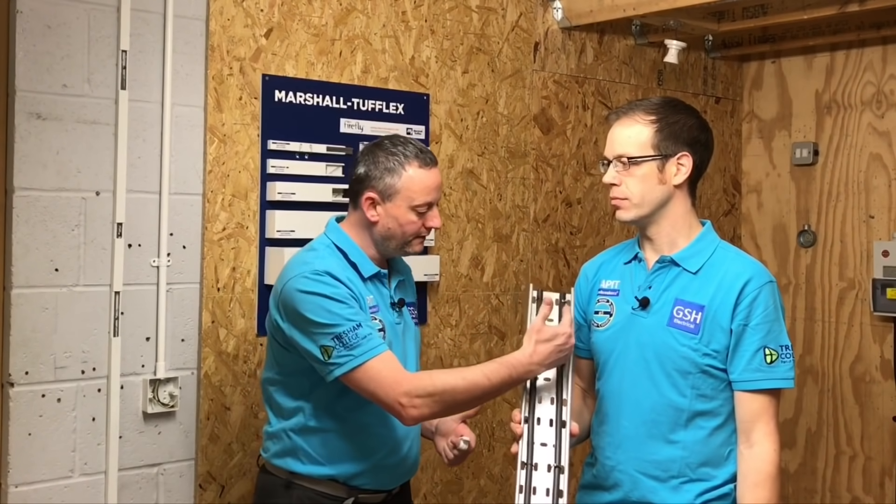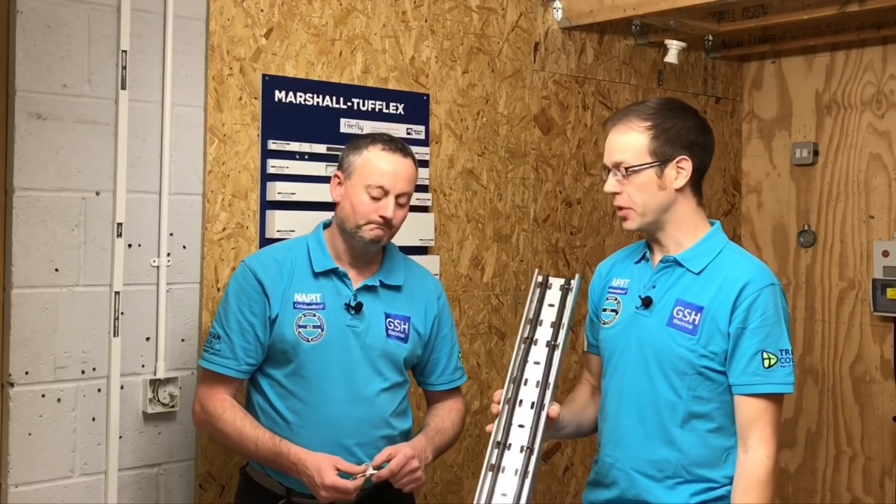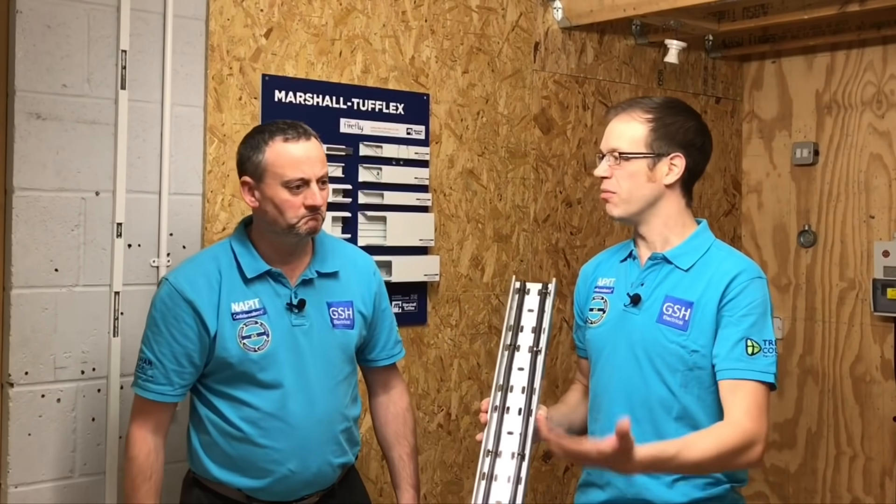My big thing is: how well do I sleep at night if I've secured this steel armour cable to cable tray next to one installed many years ago, and I've secured mine with a metal tie? Fantastic — my cable did not drop off the tray and entangle a fire officer. We're not in the business as electricians of washing our hands of it. We want to think beyond our own installation and perhaps think about the existing installation too — potentially saving a life. Is it worth dotting a metal tie every couple of meters on that existing cable and going, at least now that's been improved?